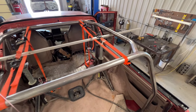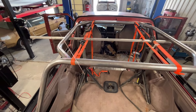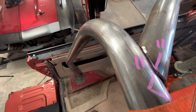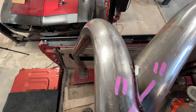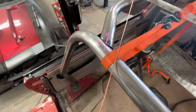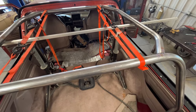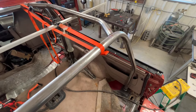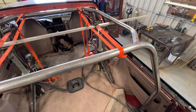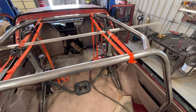I've got this thing clamped into place and have it somewhat positioned in the truck. I don't know that it's completely square yet, but for the most part all four of these joints — you can see how they marked them and where their tacks were, then they cut the tacks back off. I've got all of those very, very close. So I'm going to go ahead and re-tack this main structure, and once I get it tacked together I may add a couple of extra tacks on these tubes. Once I get it where it needs to sit, I'll locate it in the truck and might go ahead and drill the holes. I'm going to tack this thing together and we'll see if we can get it going.